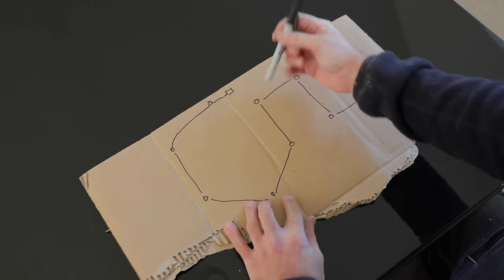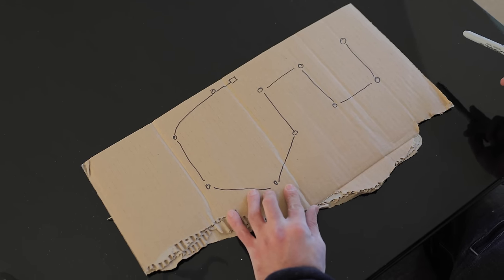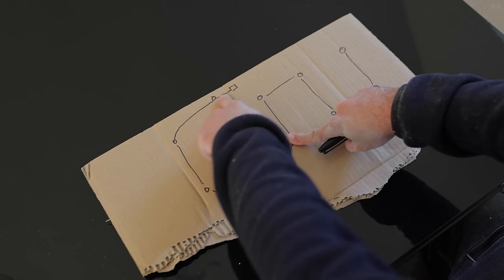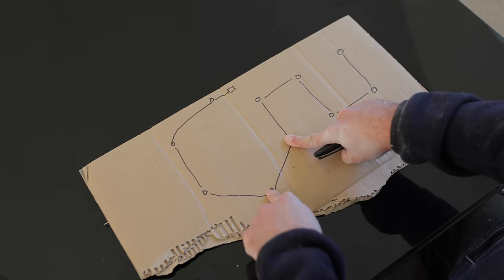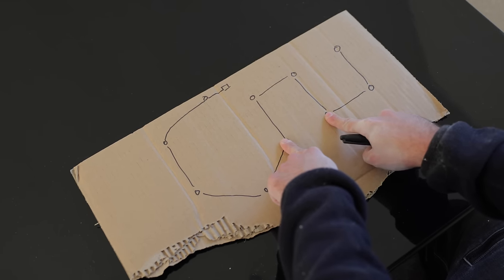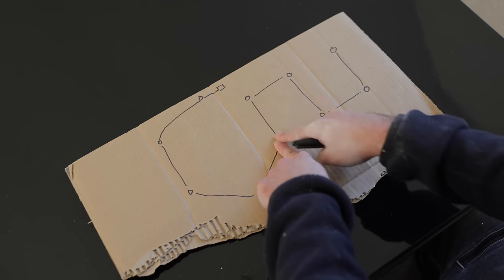So what I've done, I tested the switch to start with, and the whole thing is showing that it's down. So I've split it here, and then tested this leg and it was completely clear and this leg was down. So I've got the power back on and restored lighting to these lights here. I've then took this light down and tested both ways. It was showing that there was a fault here and this piece of cable was good.